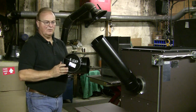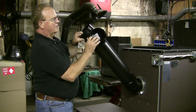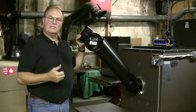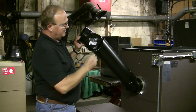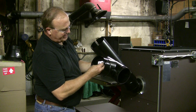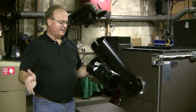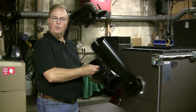This barometric damper is included with your furnace. You want to make sure that this flap is horizontal — it's adjustable, so turn it until it's horizontal. It has a vertical and horizontal scale marked on it. Make sure the little weight is on the right-hand side — that's the vertical scale, and that's the one you want. It's adjustable, and you'll see little numbers on it. Set the little knob just to the right of that line. When you first hook up, don't worry too much about this setting — we'll cover it more in the startup and operation video. For now, just set it on number four; that'll be close enough. From there you'll go up into your chimney.